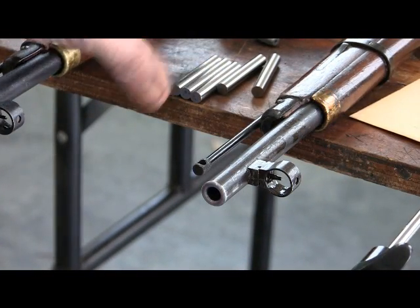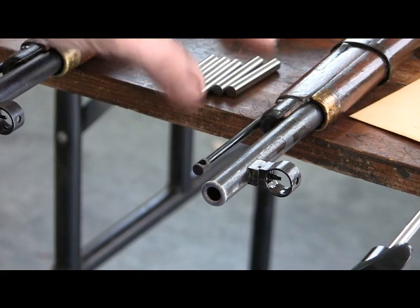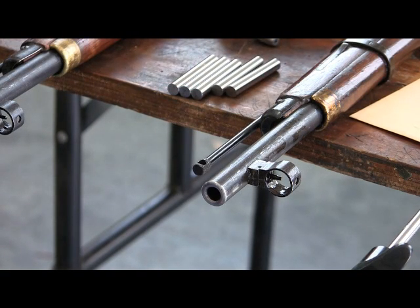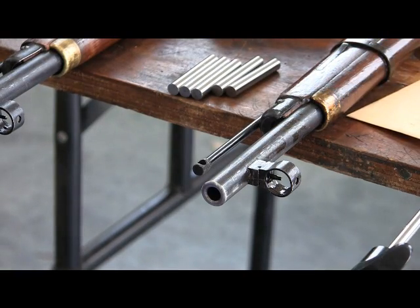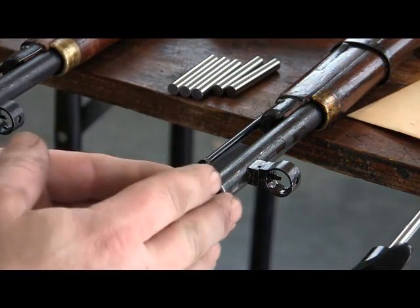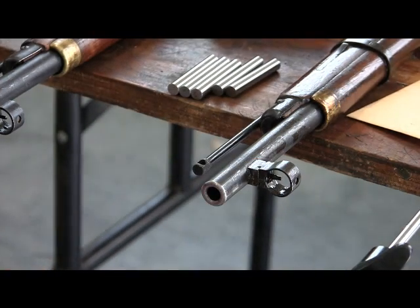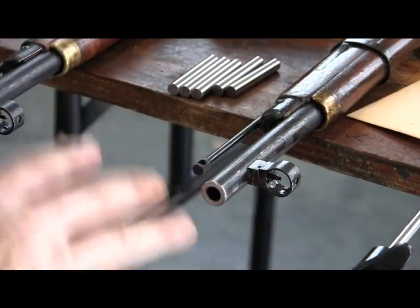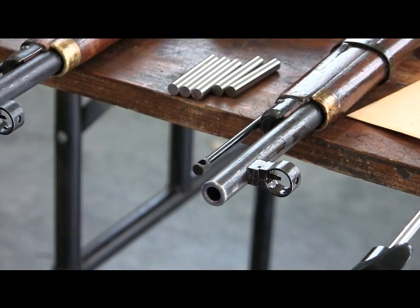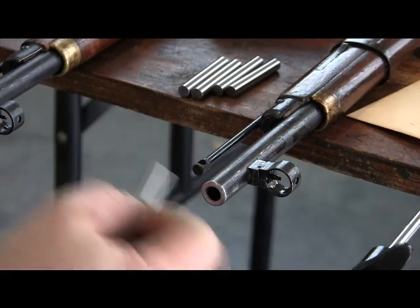You really can't do this at a gun show — it's more technical. I've had all the guns out and measured them, and I'll review what I've found compared to my slugs. I'm getting an idea of what the bore is, what the groove diameter is, and how it's varying. I also have the years marked down — pre-war and wartime production.